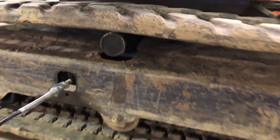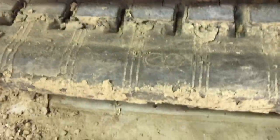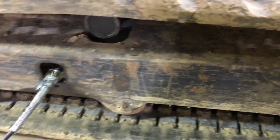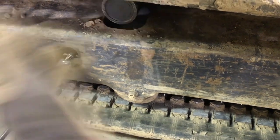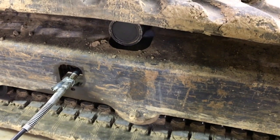And that actually needs to be checked with the seam of the track on the top roller there. So you may think it's hard to find the seam of this thing, but I've looked before and it's actually a lot easier than you think. Oh, there it is. That's the sign you're looking for. Looks like an infinity sign. So basically you roll that around to the top center here, take your measurement, add grease or let grease out as you need to tension the bottom, then spin it around a couple times each way, bring that infinity sign back to the top and recheck that.